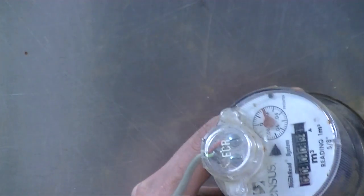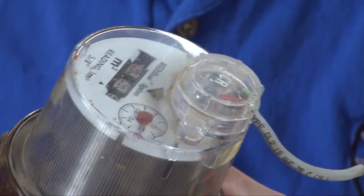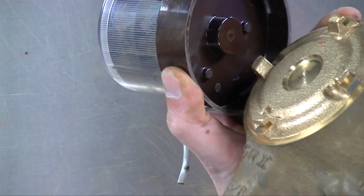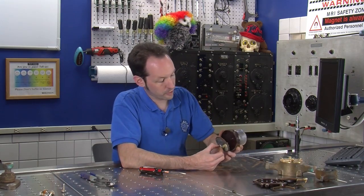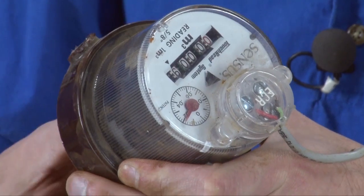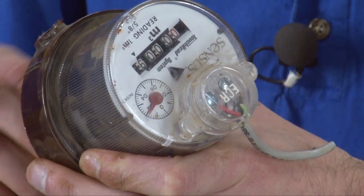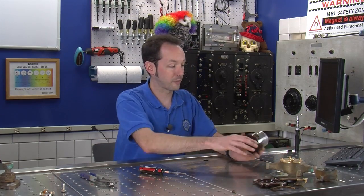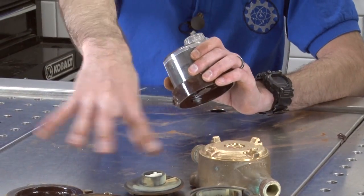If I turn the magnet, you see the little triangle piece moves. And you can see that's solid brass — there's nothing there. As I turn it now, you can't see anything move. So it's just a magnet. If I take that piece completely out of the equation and I touch the magnet on the bottom here and turn the magnet, you'll see the little triangle moves. The triangle is basically indicating that the internal assembly is working. Because there's a lot of things there, and if that gets oxidized or anything too bad, I can see that being the failure point — this is where all the moving parts are.